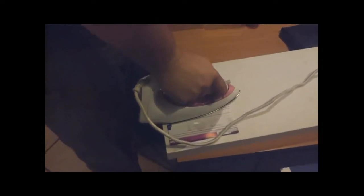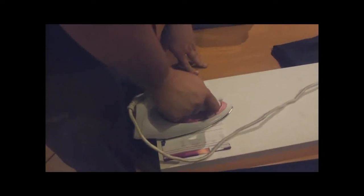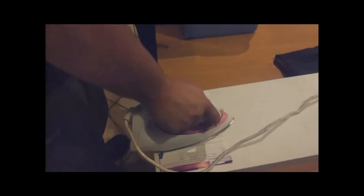Now what this does is it melts the toner, and it heats the board, and starts the adhesion process. I'll show you on a scrap piece afterwards, the toner actually gets like a gel substance when it heats up. So this is the point where when you lift the iron, you get smudges like Nick had. But must that iron be big enough to cover the whole pattern? Yes, which luckily fits your board. Otherwise, you must put a piece of metal or something, but I haven't had much success with that. I think what I'll rather do when I get to bigger designs is modify a laminator.